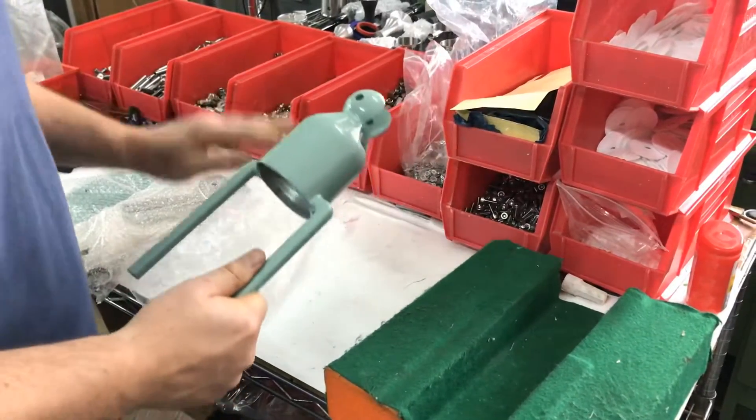The other thing I need to do is sand the inside here, because after sandblasting there's some overspray and it's a bit rough, so the piston won't go in and out. That needs to be sanded — I do those in lots of about 20 before we get to this stage. So my first job is a quick look for powder coat defects.